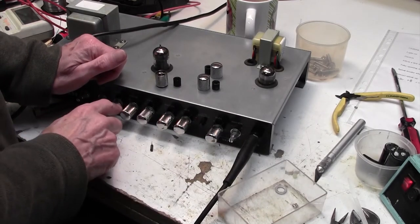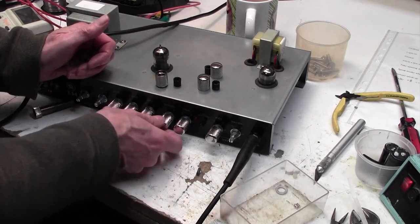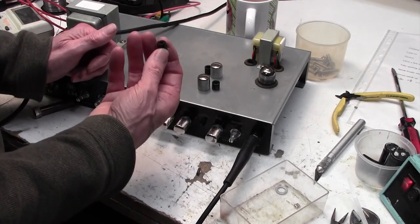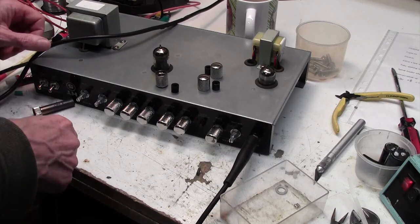I decided to try some of the knobs without gluing them on. And all of these knobs work perfectly okay and don't show any tendency to rotate — without any glue, apart from on one of those. These three do rotate in their collars — I don't know what the difference is. So I'm going to glue just three of these. Well, there we go — another live fix under our belts. Blackstar HT5R, R standing for reverb. I'm very pleased to have fixed this amp, because now I can put out this video. And in years to come, I'm hoping to save 50, 100, maybe a couple of hundred of these from being thrown away for want of a capacitor change. So thanks for watching — a nice fix. I'll catch you on the next video.